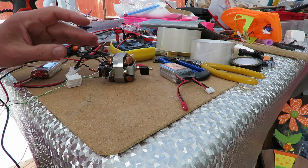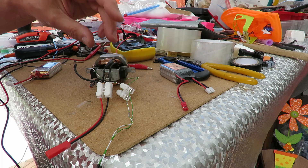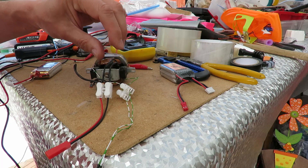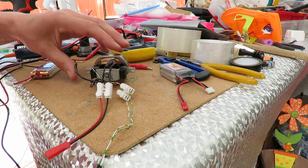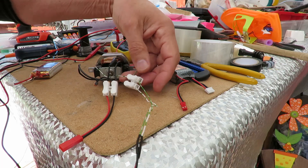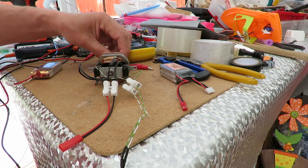So I've got it rigged up. I've separated out all the wires and the coils. The top field coil is these two wires, the bottom one is these two wires, and these green ones are the ones going to the brushes that feed the armature.